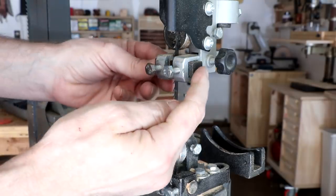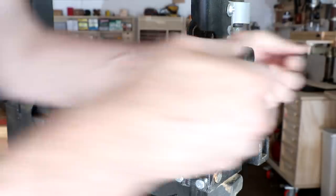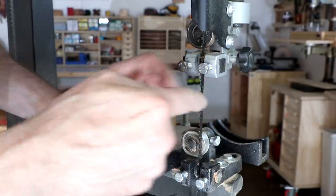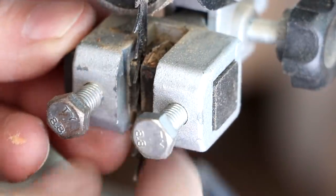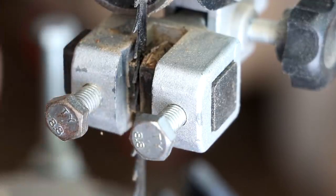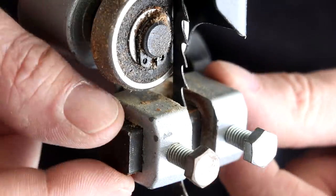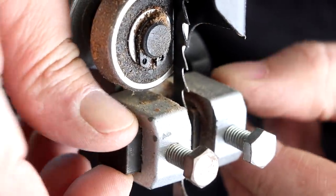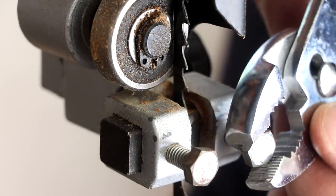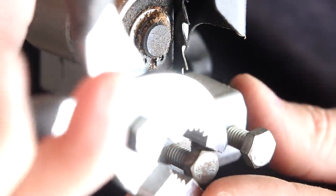Once you've got the blade in, there are a couple other things you need to set. These are guide blocks that grab the side of the blade. You want to adjust them so they're almost touching the blade but not quite, and also not on the teeth. This will slide forward and backward — I want it right about here so it's not grabbing the teeth but just on the back part of the blade. These two blocks will provide pressure on the side of the blade, but you don't want them clamped down preventing movement. Just put them next to the blade and back off a little bit — about the thickness of a sheet of paper. Or you can buy what are called cool blocks — some sort of plastic material that you can press right against the blade, and you just replace them when they get worn out.